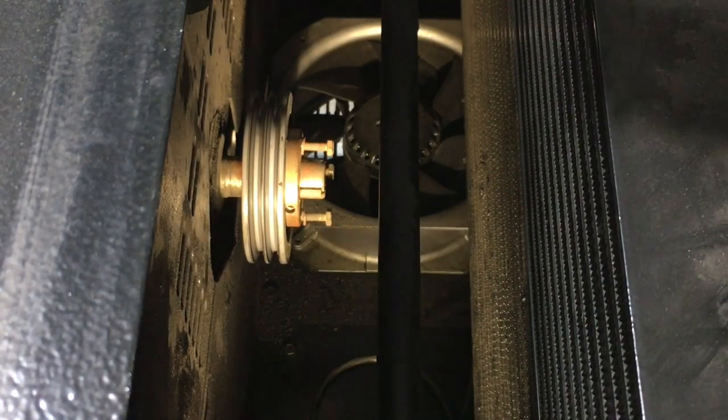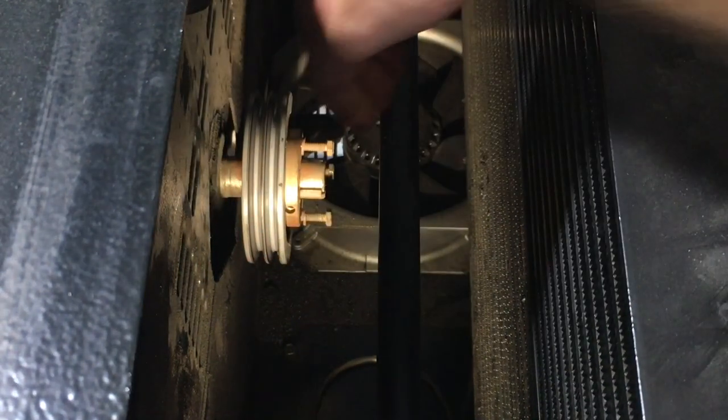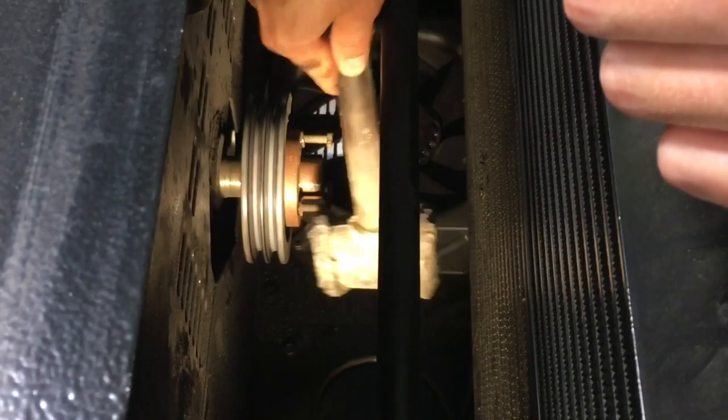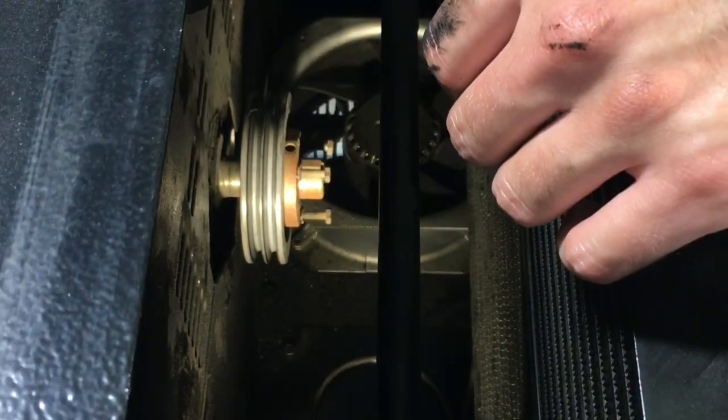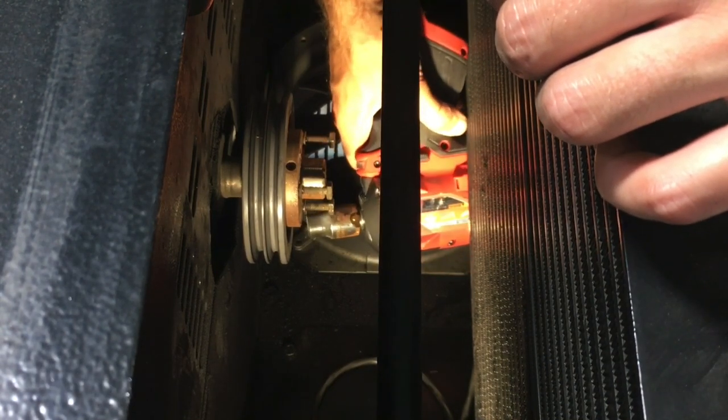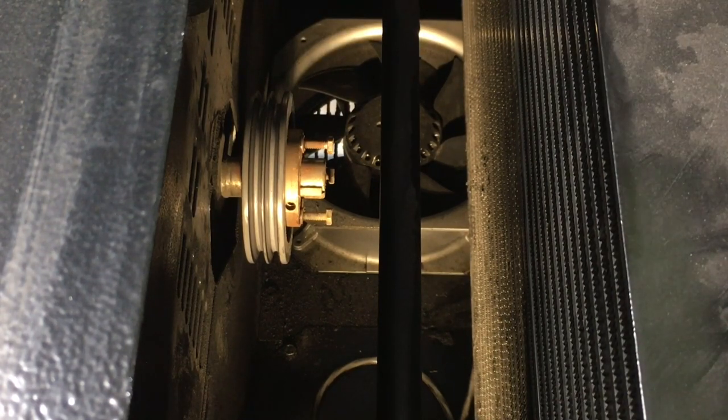Okay, so now they all hit something, I'm assuming is the sheave. So I'm gonna try just turning them. It shouldn't take a whole lot. Still tight. No movement yet. Got one of these rubber band, like filter wrenches or band wrenches. If I can use this to hold the sheave. It feels promising.